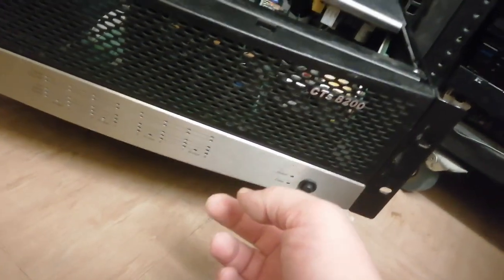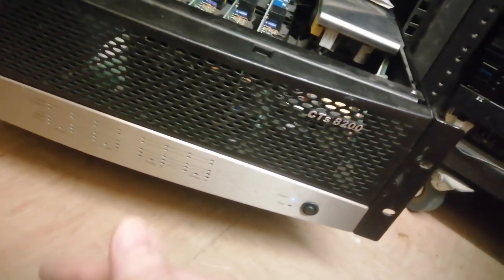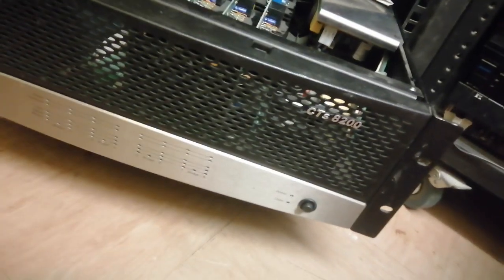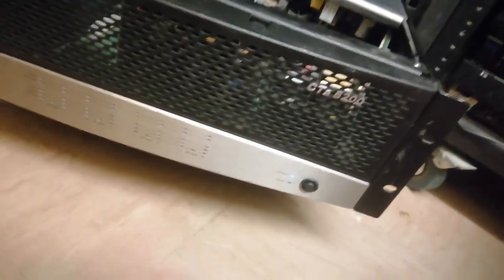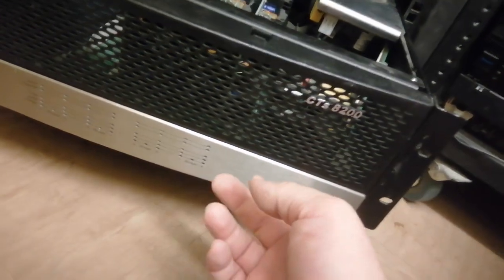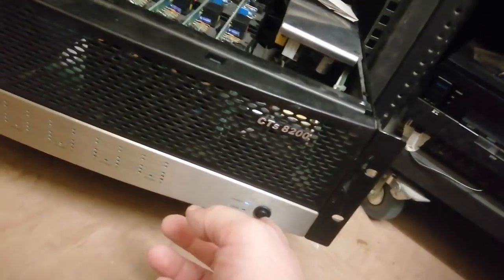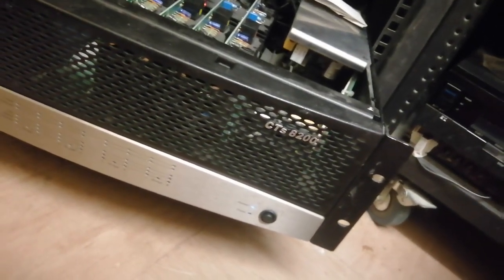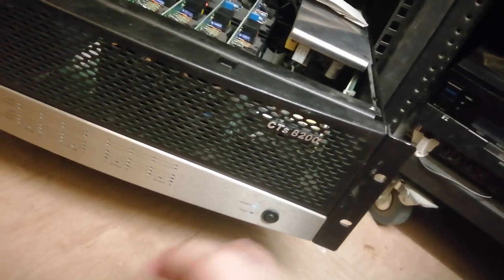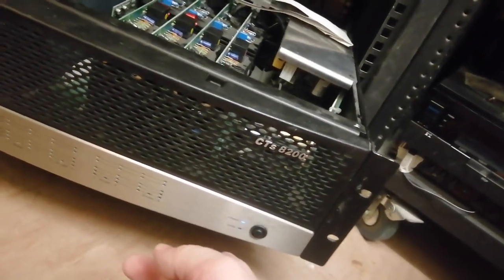I had a similar issue with an Alesis many years ago. I replaced the amplifier, turned it on, but while it was turning on, getting low frequency signals mostly, it would make a kind of click, click, click, click, click. It made a strange sound. And so I put the question around, and someone said, yeah, they know what it is. Many other owners have mentioned it, and it turned out to be a relay. And what I did was buy a new relay. It wasn't too much of a big deal to strip the amplifier down, and we'll put a new relay on.